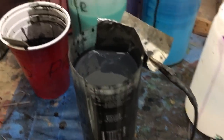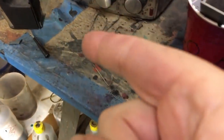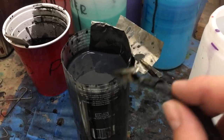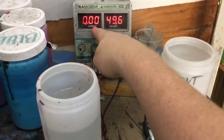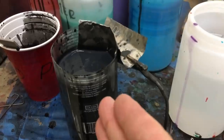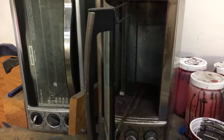The ceramics are a liquid that is electrically applied. You use these hooks as both the hanger in the oven and the electrode attachment point. You apply the ceramic and attach the hook to the electrode — negative lead here, positive lead here — and it attracts to the positive with this power supply. When you get a zero on the amperage, that means you've completely applied your ceramic. You rinse off any excess, look for flaws, and bake it for about 30 minutes in a toaster oven on its side.